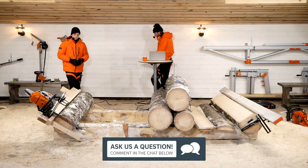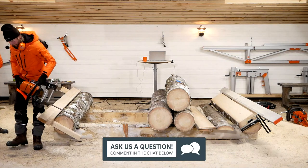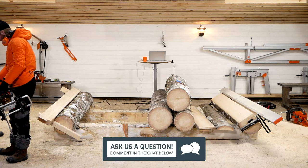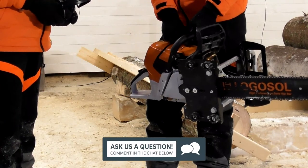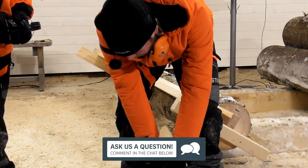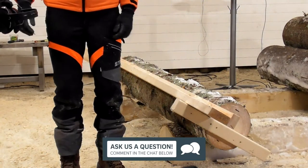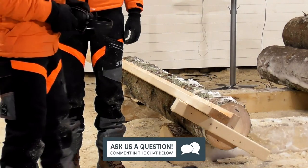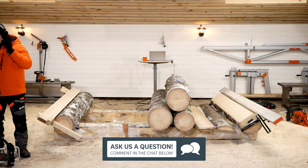All right. But what we can do, we can prepare just to start up the saw now. Perfect. And now it's a little bit cold, and this saw has been resting a little bit now. So you can put it down to the choke, the bottom position here. Press down this compression button, and then you can start it either like this, pull start it, which I would recommend, or between the legs. I would also prefer to have it on the ground. So here we go.